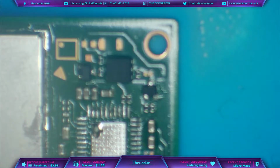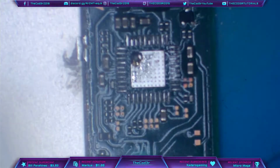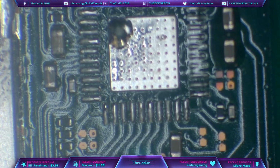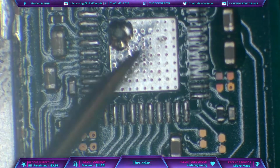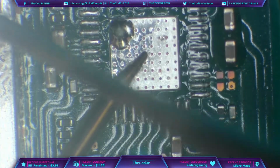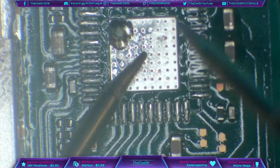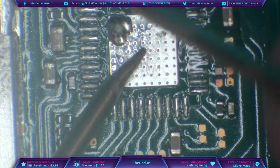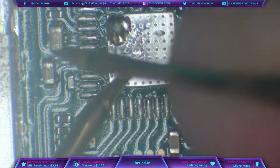But that's fine. Right, okay, so now that the chip is removed, I'm just going to make sure that there's no bridges on any of the pads around M92, and they do appear fine. So now I can pop one probe on ground again, and I'll use the middle pad. So if you look there, I can get a continuity there because that's a middle pad. That middle pad is ground. And if we pop the other probe on these now, the short is relieved.